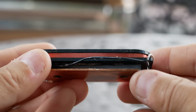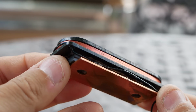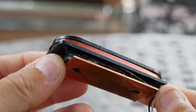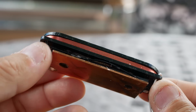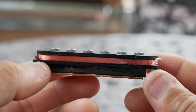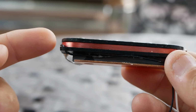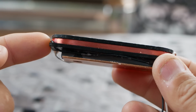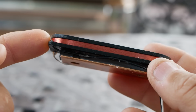Very cool. It gives you another indication of why using the resistance itself to understand what a pickup sounds like, and the overall sound and inductance and everything, has nothing to do with the resistance, because this pickup is louder than a Tele pickup, is louder than a Strat pickup, but it has fewer winds than both.